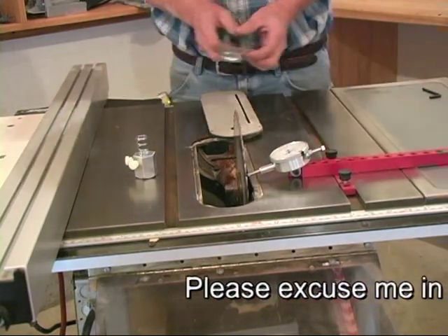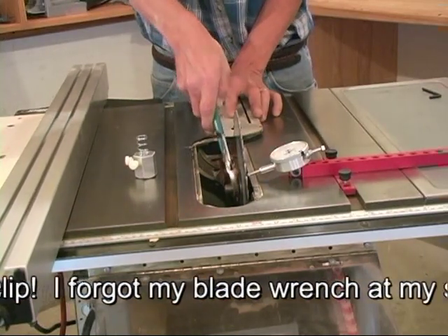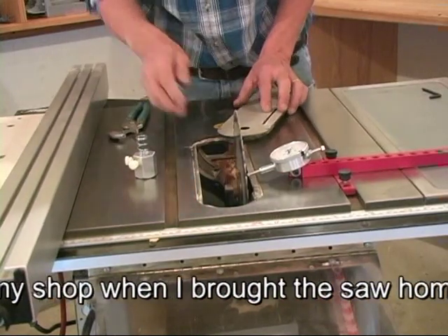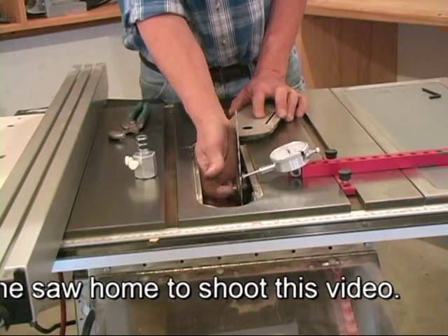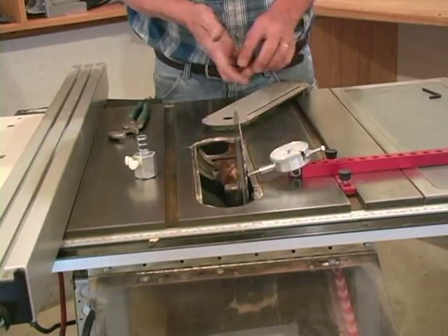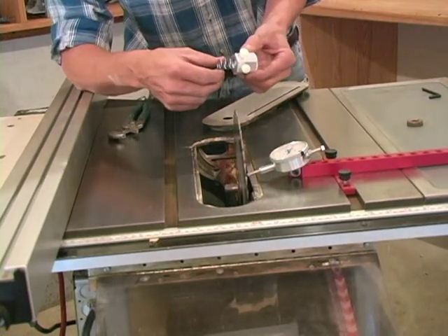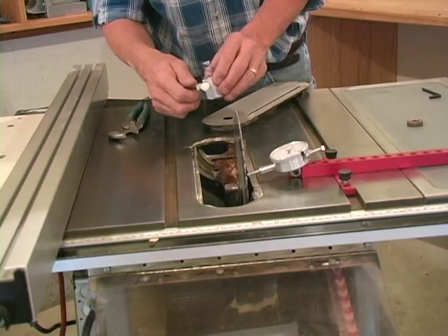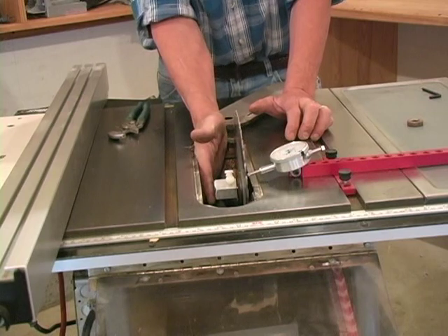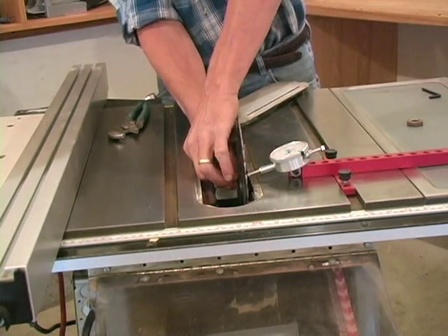Now what we're going to do, just to show you how that works, I'm going to take the blade nut off. We're going to leave the washer on. The spring inserts into the nut, and what we're going to do is make sure your nylon thumb screws are backed out, then you go in there and compress that spring right down on that arbor shaft, and then you lock this down.